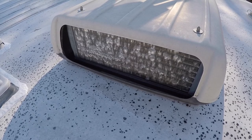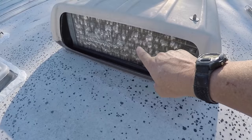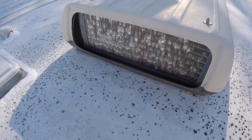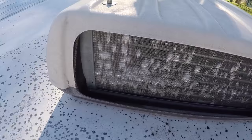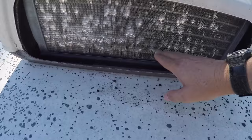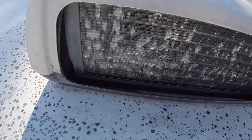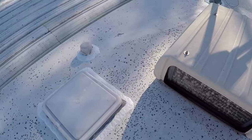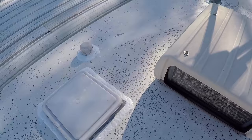Next project — I'll probably do this on another day — you can see the fins on the back of this air conditioner all bashed in. It's another job that's not very much fun, but in order to allow the airflow through that grill, which is what takes the heat out of it, they need to be opened up. You can take a screwdriver and go down each one, but I've got a tool that's kind of like a small comb. Take the top off and I can just rake it through, and it'll rake those fins out a lot straighter. So that'll be my last project up here on the roof.